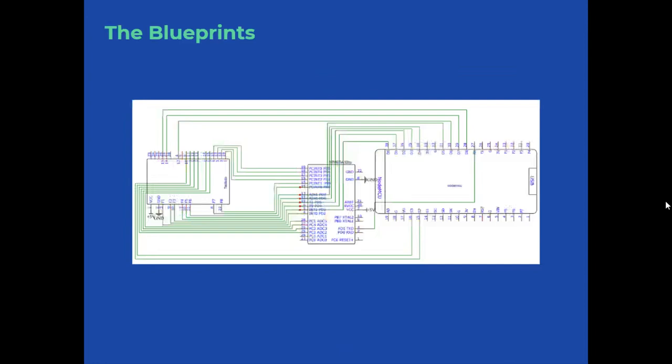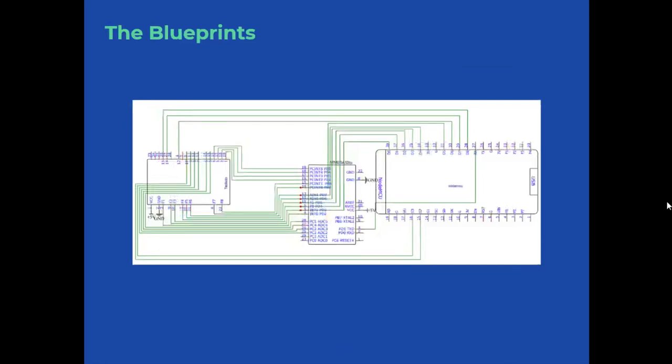Here is the schematic. The Arduino and the ESP are connected serially, which means that one transmits and the other receives. Every keystroke is received by the keyboard board. The first thing done was determining which are the rows and the columns of the keyboard PCB. When a key is pressed, it works as a close, that is, the row and the column are in contact. The Arduino also waits for the click.